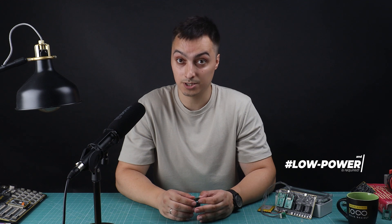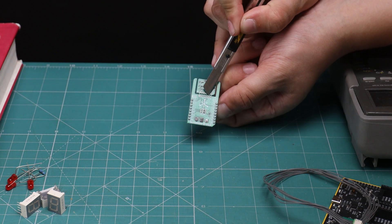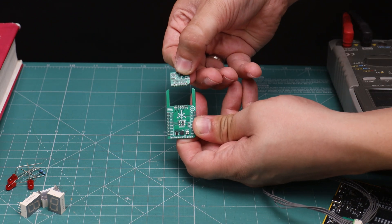Here are the steps to create space-limited applications. Perform several cuts on the front side of the bridge to weaken the snapping PCB. Perform several cuts on the back side of the click board as well. Then perform the snap along the weakened lines using your hands. Finally, your compact board is ready for further integration.